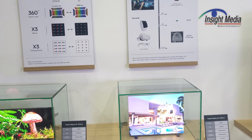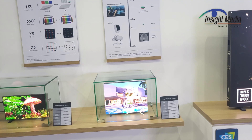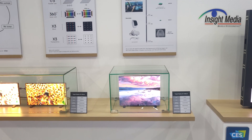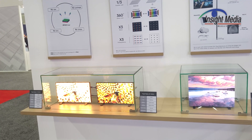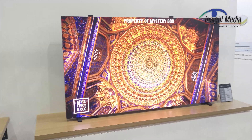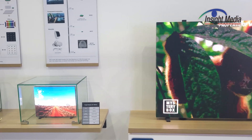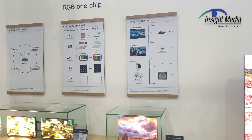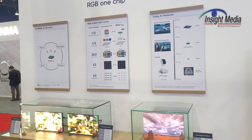These are all on PCB backplanes. If they want to really get to micro-LED size, they're going to have to go to smaller devices — smaller than 100 microns, getting to 50, 20, or 10 microns. Vertically stacking at that scale is going to be a much, much bigger challenge. In addition, they'll probably have to go to a glass active matrix backplane as well, which creates additional challenges and opportunities. But it's a great step in starting to work with mini LEDs to create vertically stacked devices, which can create a nice path toward micro LEDs.